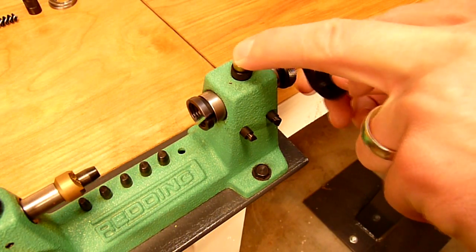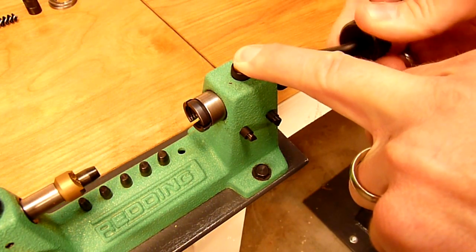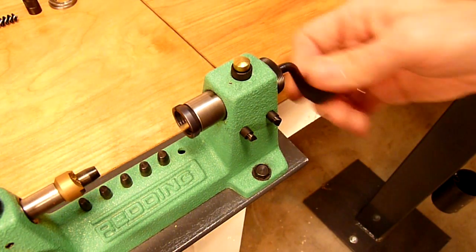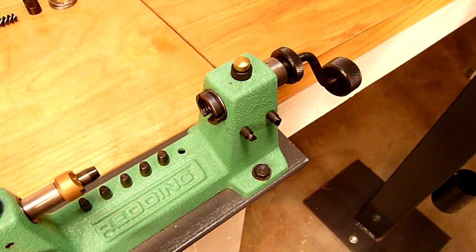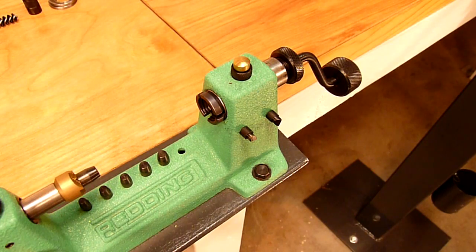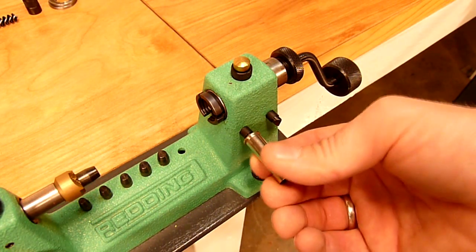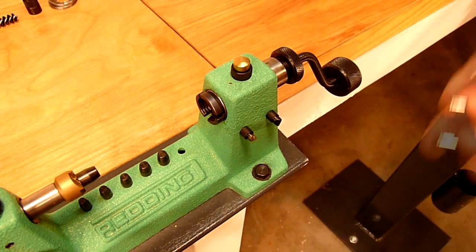This pin up at the top locks the shaft so that you can either release or grip the brass. It makes for very quick use. You let go of the pin and you can then turn the shaft so that the brass trimming commences. We've also got a small and large primer pocket cleaning tool, which makes for very easy and convenient primer pocket cleaning, regardless of whether you're cleaning something like 357 Magnum with a small primer or 223.